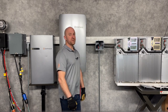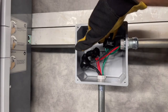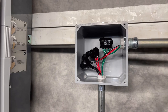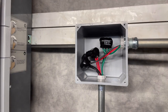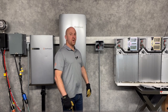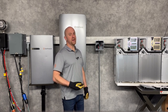Another option for splicing inside of a standard junction box is to use multi-tap connectors or insulated lugs. Make sure that you have a large enough junction box for these — here I have a 6 x 6 x 4 inch model. The connectors I'm showing here are indoors or dry environment versions. When outside for outdoor applications, be sure to use the wet-rated models.